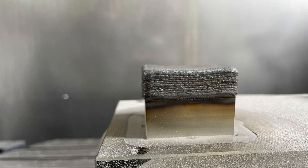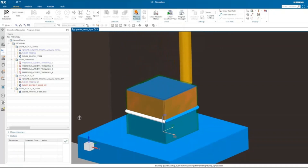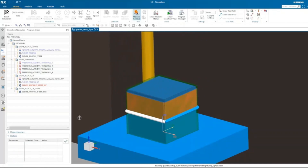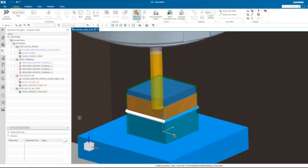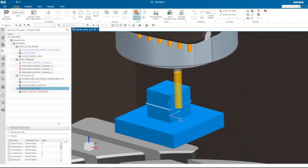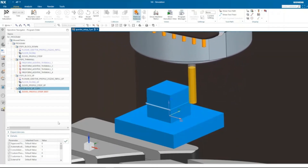We have this result. The upper part had a little offset — slightly bigger than the lower part — and the two parts are welded together strongly. We need a milling operation to get good surface finish and exact size. Any metal 3D printed part needs milling operation. Using a face cutter, we cut away the top surface for good surface quality and exact height, followed by side wall cutting. The mating point between the two blocks is also cleared away by end mill, and they will have a clean surface.